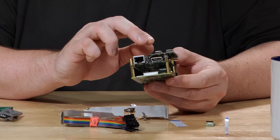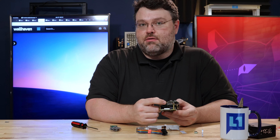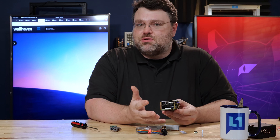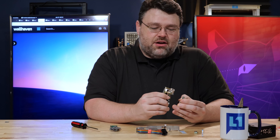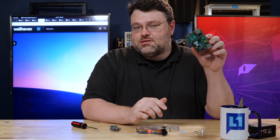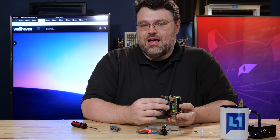The reason this exists is for devices that are problematic with USB emulation. This USB on-the-go connection goes to the Raspberry Pi — the Broadcom controller has USB on-the-go built in, so you can use that interface to emulate peripherals: serial devices, keyboard, mice. It works great on almost everything, but some people might be using really old or crappy servers with a buggy BIOS. So there's a true HID human interface device board based around the Atmel AVR — a second programmable microcontroller providing a USB-C interface for keyboards and mice. Some KVMs want explicit keyboard and mouse ports, and this gives you that.